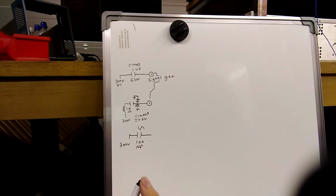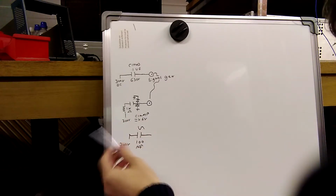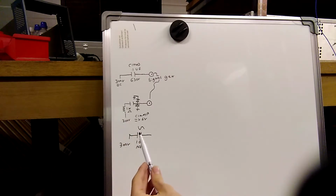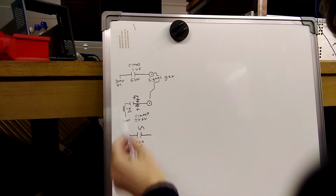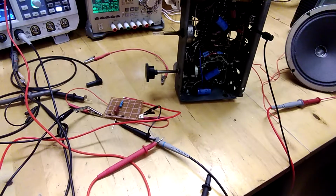I don't know any signal generator which should die at 0.6 volts DC. But nonetheless, okay, and that's a simple way of doing it. The problem is there'd be no current limiting if you've done this without any resistor beforehand or after. Doing this without current limiting means if this capacitor completely breaks down on a radio's B+, you're going to get the full output of that radio through them diodes.